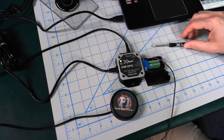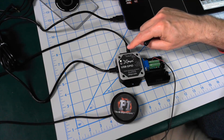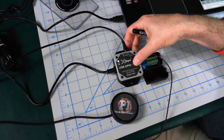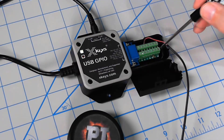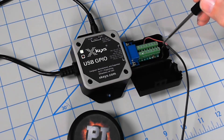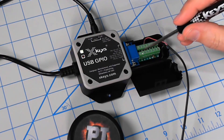If you look at the GPIO, I have this switch plugged into one of the inputs on the side here. And for the output, I have from the HD15 connector the screw terminal. Pin 10 is going to the ground wire on that relay, and the positive is going to pin 13, which is my first dedicated output on the GPIO.